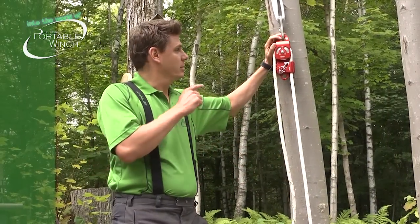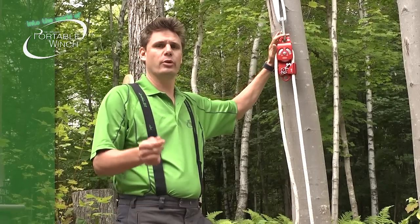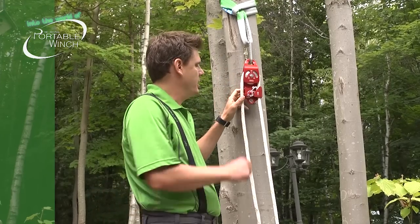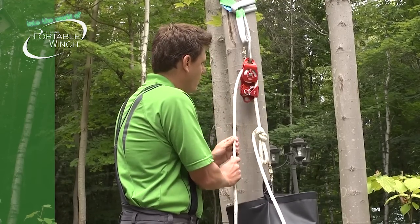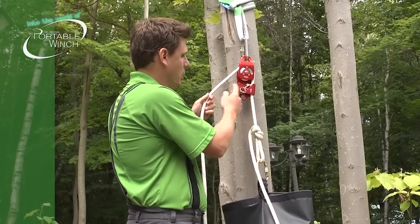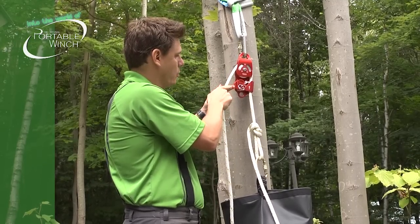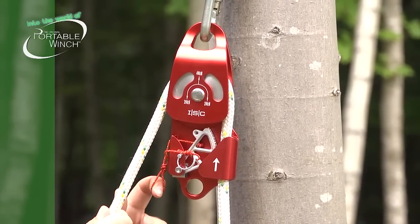I want to take a few seconds to talk about the self-blocking pulleys. One important thing is that when you're using that kind of pulley to lift, it's really important to follow the rules and regulations that apply in your area. So here I have the pulley installed and my rope is already in there. The great thing about this pulley is that it has a locking mechanism or a cam. When I lift the load, the pulley locks the load in position — it's suspended and held. When I'm ready to lower my load, all I need to do is pull on this little string here. If I use that pulley very high, I can attach another rope so I'll be able to pull from the ground. To release the tension, I just pull a bit on the main rope and then on the cam and it's opening.